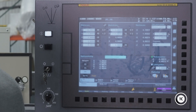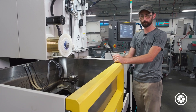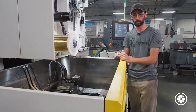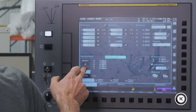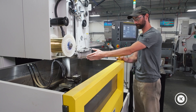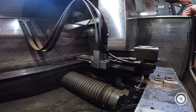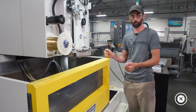When going from setup 2 to setup 1, it's going to move over and jog the head down, but it will clear the Z-axis before it moves. That won't save you if you have something in between the setups, but when moving between user points it will clearance the Z-axis before doing anything. If you're going to a taller setup it'll pick the head up first before it moves; if you're going to a shorter setup it'll move and then drop the head down — very convenient. Zero everything out, no need to pick up Z, just zero out your absolute positions and run your program.